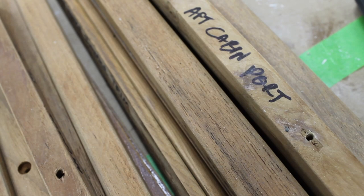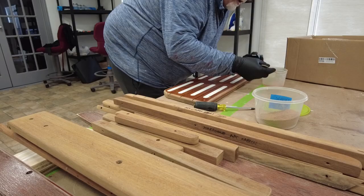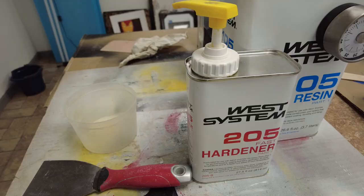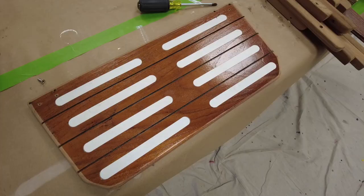The piece of wood might be in pretty good shape — it's just got a crack, maybe even a structural crack — and you want to know how to repair it. Teak and some of these exotic woods are quite expensive, and to remake a piece might be beyond your skill level or just something you don't want to mess with. The way I've found to repair the crack is to use a little bit of epoxy. Some people use glue, but I personally don't — I haven't had success with it. I find epoxy makes the repair spot stronger than even the wood around it.